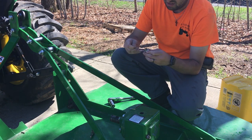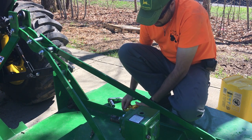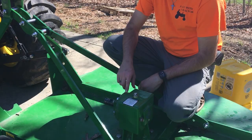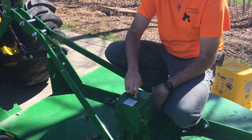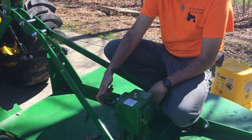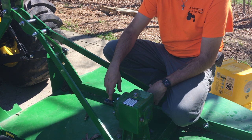This plug is actually a pipe fitting, so we're going to want to put some Teflon tape back on there before we put it back in. Sorry the video cut out — I got the Teflon back on the vent cap and put it back in. The other thing I did was wipe off the input shaft that goes into the gearbox and cleaned out the ring where the snap ring goes to hold your PTO shaft on in the event your bolt were to break.